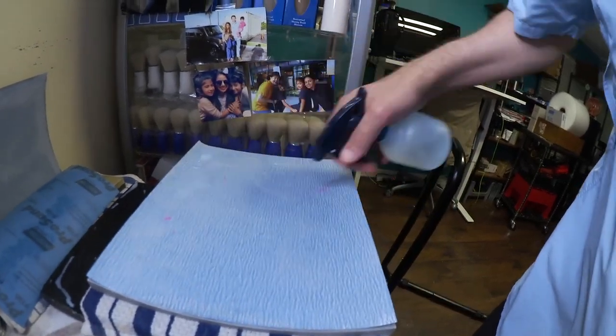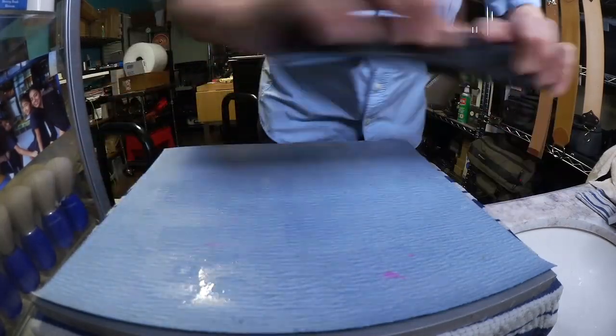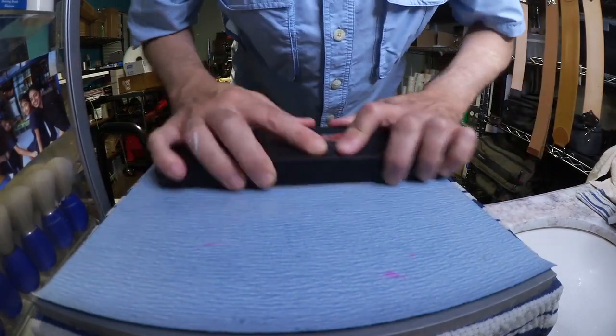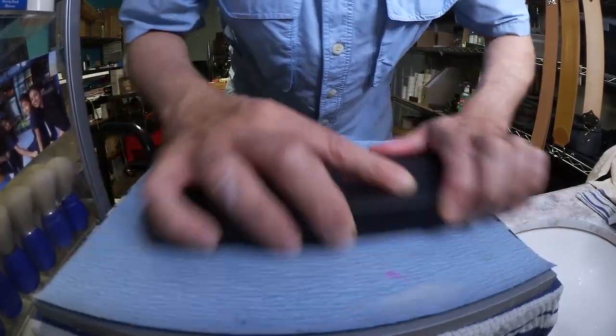I'm going to put this 150-grit ProSan from Norton — this is a silicon carbide-based paper. The stone was shaped with its 10-inch axis facing the 11-inch axis of this plate, so when I resurface it I will do the same thing, because it is an ellipse. You can't go different orientations — you have to put it on there the way you shaped it the first time, like this. And you just go like this. It don't take much because the stone keeps its shape really, really well. So this surfacer is extremely close to the shape that's there and just works to make the surface have a little bit more friction on it.